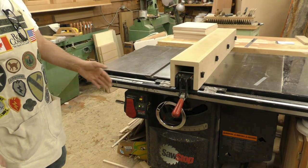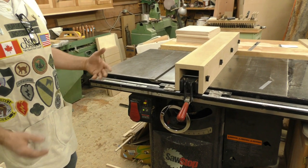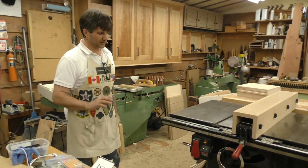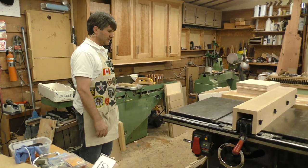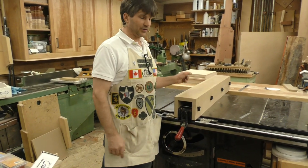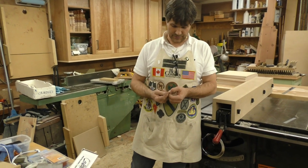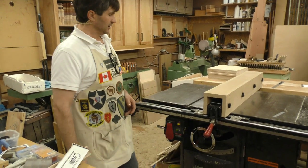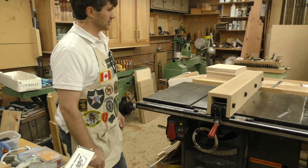The only step up is that you can get a 5 horsepower, maybe even a 7.5, but really, unless you're running the saw all day long, 3 horse is fine — never stalled it, works great. We have tripped the cartridge a few times. A guy that works for me actually got his finger into the blade one day, and it only took a couple of minutes to go get a band-aid and close a little cut in the end of his finger and he's back to work. So if your digits are important to you, get yourself a SawStop.